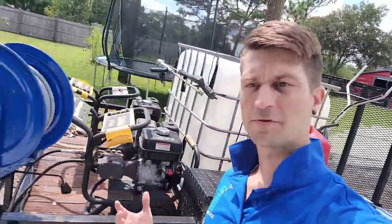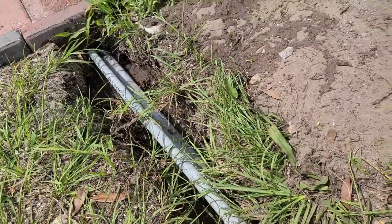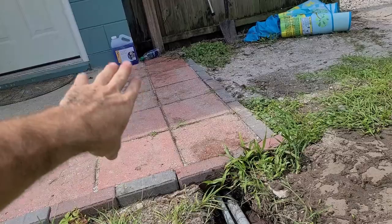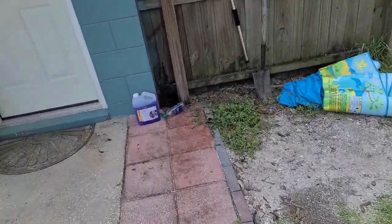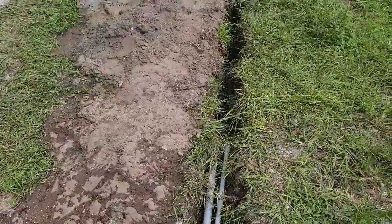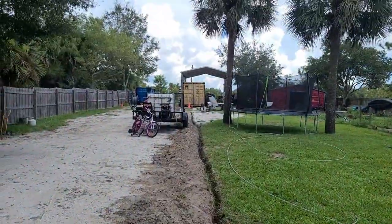So I'm bringing 70 amps of power back there. I ran this gray tubing underneath, connected a hose to this side, turned the water on, and basically pushed the pipe through with the water — pushed the dirt out of the way all the way to the other side of the concrete. I've got the power on the bottom and the internet on the top. They're going to go all the way back to the Conex. I have to climb in the attic now and run my internet cables out of the attic, down the house, and through the trench all the way back to the Conex. It's a lot of work, but it's going to be amazing. Smash that like button and continue watching to see the finished product.